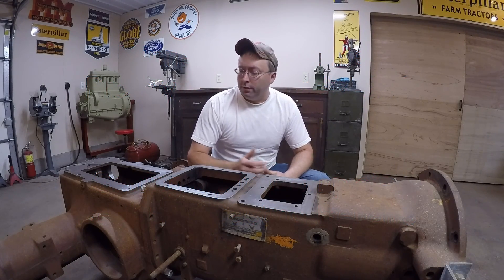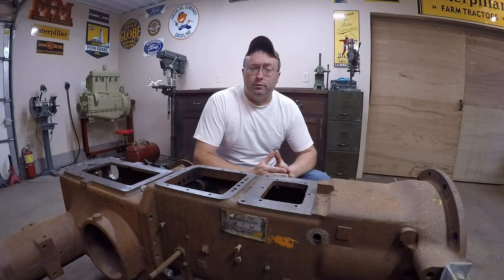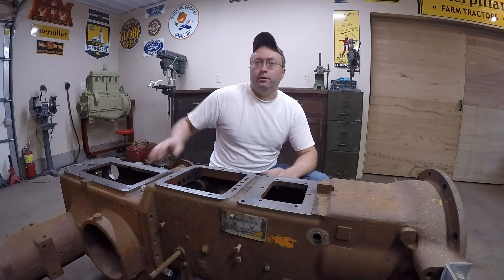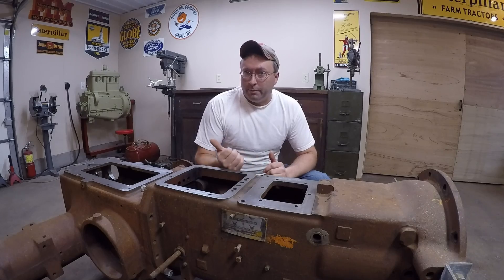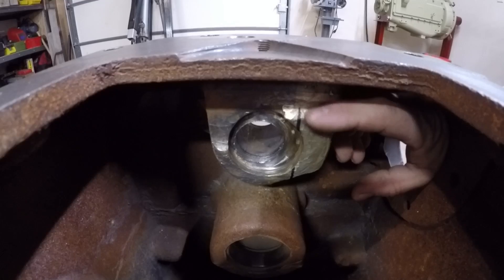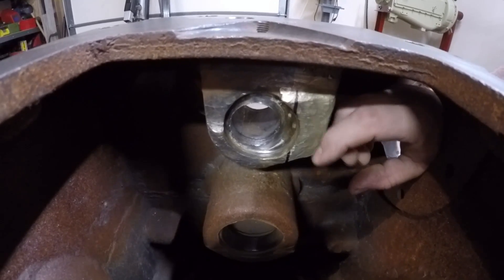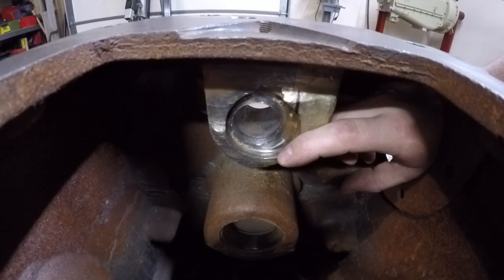Welcome back. If you've been keeping up with the X2-31 restoration videos, you'll remember the last one - I believe it was part 16 - where I talked about some of the failures that happened back here, the damage that was done to this rear end casting and some of the repairs that had already been performed to it. It's time to complete those repairs. There's a lot of machining to do in the back end of this thing, mainly in the area of the rear end housing where the live power shaft bearing bore is. This side was extremely thin, had cracked out, and the bearings had spun back here and scored the bore.